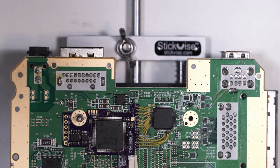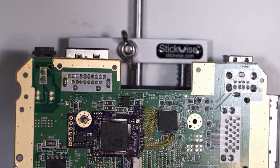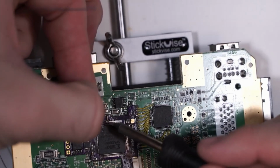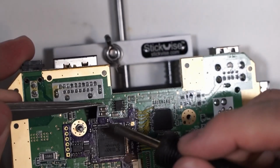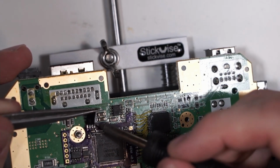So we're going to go ahead and attach that, and that board carries the infrared signal wire, the wire for the infrared switch, and it also carries 3.3 volts and ground for powering the whole system, and that all comes off of the AV connector, which is actually pretty convenient if you ask me. It's a lot of functionality in one. Probably if I sell kits of this, I would pre-solder the ribbon cable to the two halves. That way you don't have to mess with it, because it is such a short run. It's kind of a pain to do in place.